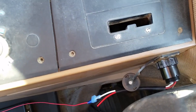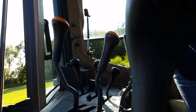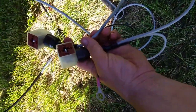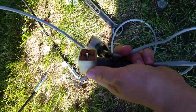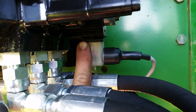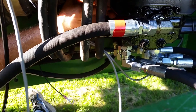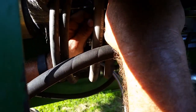Now there is a power source going to the joystick. When the buttons are activated, that carries the power down to the third function on the valve, which opens and closes the grapple. Looking at the opposite end of the wiring harness under the tractor, there are two pieces that plug into the solenoid valve — both solenoids on the electric third function — and then the black wire is the ground. The wiring harness needs to be plugged into both sides of the electric spool on the valve.